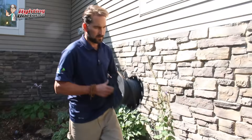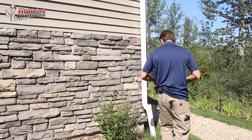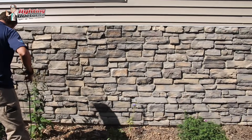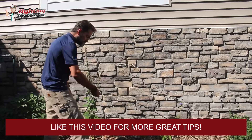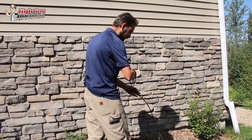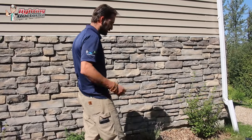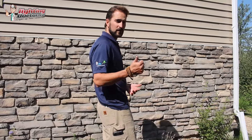I'm going to walk my wire out to every single light and make sure I've got lots of wire. I'm going to leave my loops at every single light, just making sure I've got lots of extra. If there's one thing I've learned, you can never have too much wire — it's usually the opposite, and you'll find that you're short. It might not seem like a big pain, but it'll save you so many headaches down the road. Lay out your wire, place your lights, and then you're ready for the next step: getting everything wired up.